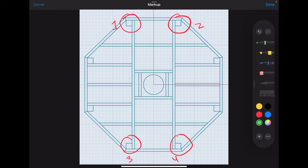What I did from there was connect these four 2x6s between my four posts. Now, at this point, only post one is actually concreted. After the concrete had set up, I attached these 2x4s. These 2x4s are just scrap. They're not going to be there long term. Their sole purpose is to hold the posts the correct distance away from one another.